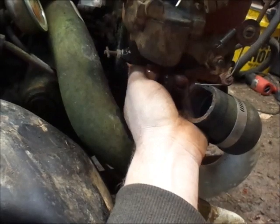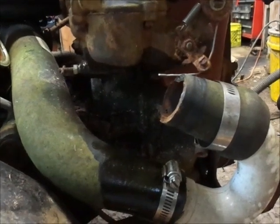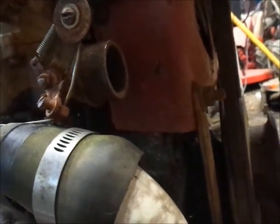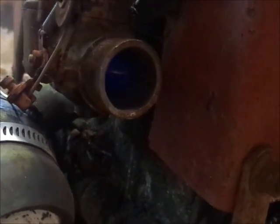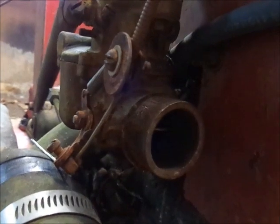Always when there's fluids running out at you, it's harder to start. So obviously, it's not cranked down tight, so it'll probably drip. But what I want to look for is, does it start running out the carb over here? Like the float's stuck. One second, I gotta switch just a second. I'm not seeing anything as of yet, so I think we're okay there.